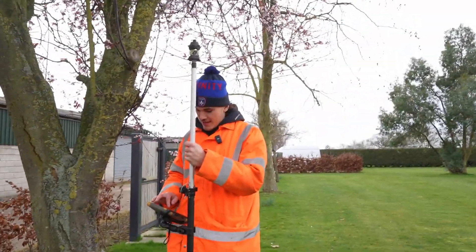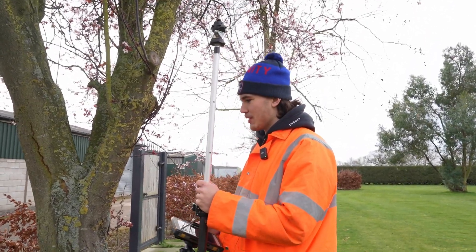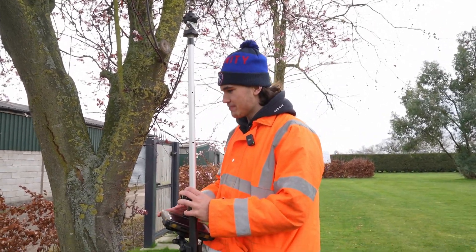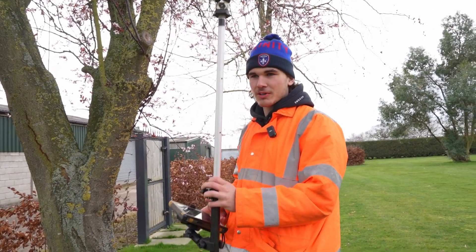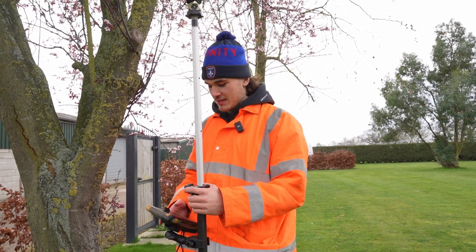Charlie, tell us what you're doing today. Just a quick topographical survey — getting trees, hedges, boundaries. Got a bit on GPS and a bit on the robotic, just did a hybrid resection. It's a nice big field which makes it easy. It is important to know you're probably going to get more accuracy on grass doing a traditional topo. Having said that, the drone data is still going to be usable because the grass isn't very long — it's been cut recently.